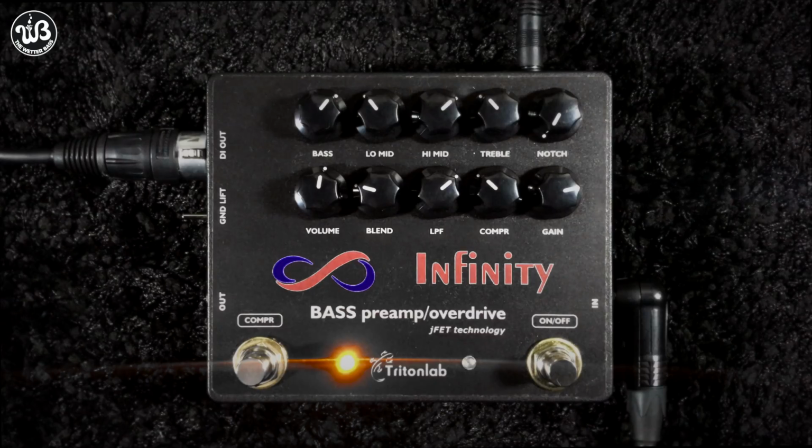The notch filter is a cut function with a narrow Q at around 400 Hz, giving the sound a warmer, Ampeg-ish type of character. Along with the LPF, you clearly have the impression that you are playing through a bass amp. I really do not feel the need to play through a cab sim with this preamp, which keeps the signal chain simple and pure, in a way.